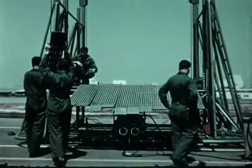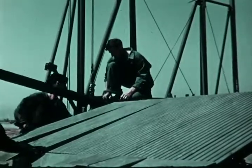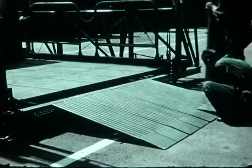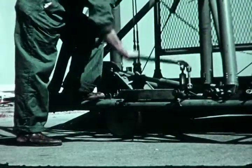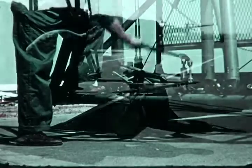A sectionalized dock board is hooked on the rear edge of the platform for bridging the gap between the Aerolift and the airplane cabin floor. The sectionalized design compensates for various airplane attitudes. With all sections secured, the ramp and dock board are each 9 feet wide. To make the unit mobile, the hard rubber-tired wheels are extended hydraulically.